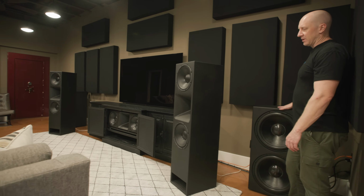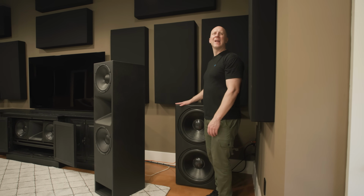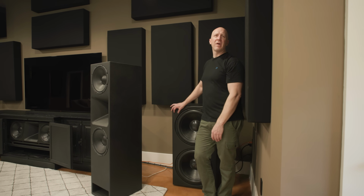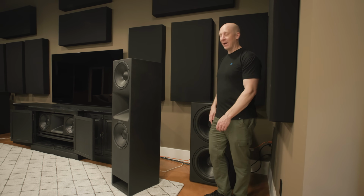And so this subwoofer and those components will be fine on a dedicated 20 amp. I think these will draw somewhere around 10 amps peak. And then if we have another 10 amps of headroom for our Class D amplifiers and preamp, we'll be perfectly fine there. And then we have one final circuit for the near field subwoofers that are in the back.